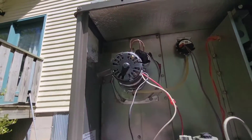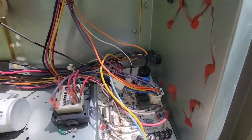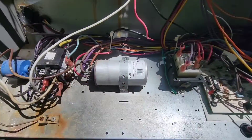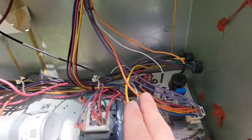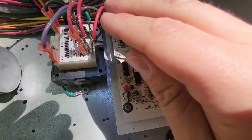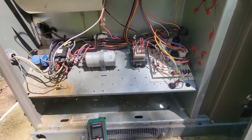The inducer motor is running, but it's on low speed apparently. It doesn't sound like it's at full speed. So we're going to check now from this side of the contactor — where this white wire is — and then to our red, and from the white to the black, to see how much voltage this board is sending our inducer motor. You can see lights blinking one, two, three times. We'll talk about what that means in a minute, but let's measure the voltage.